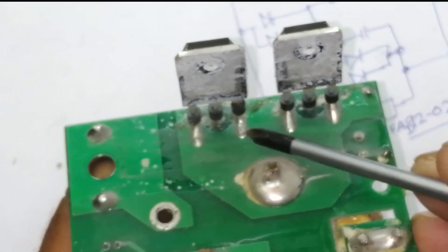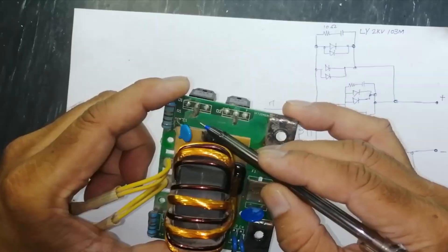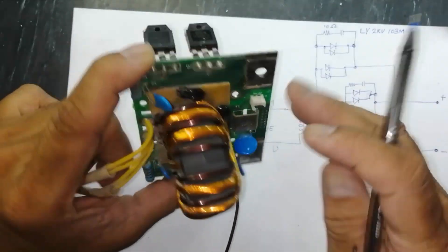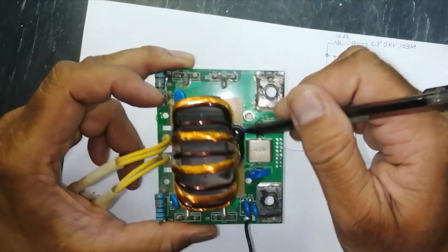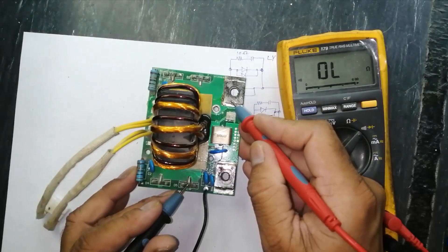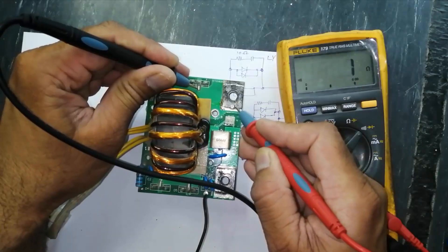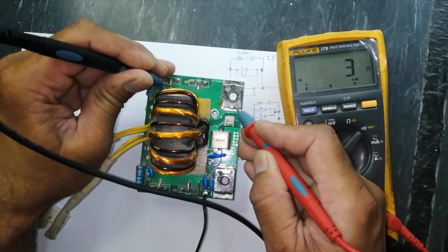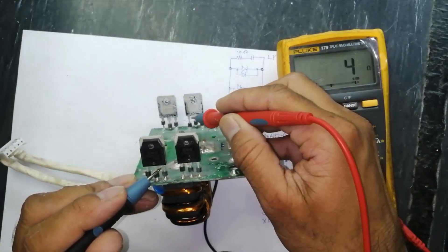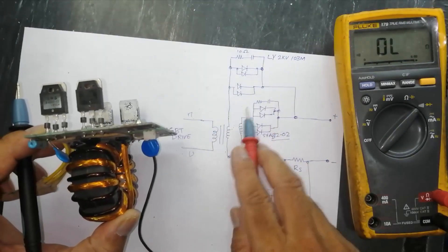Four anodes are connected to this winding and the central point is the output cathode. Both cathodes from each side are connected together to the output terminal. All four diodes on each side are connected in parallel so they can provide more current. The cathodes are connected to the same point from the inner side of this fiber sheet. Because it is a center-tap winding, in each half cycle one set of diodes will work.